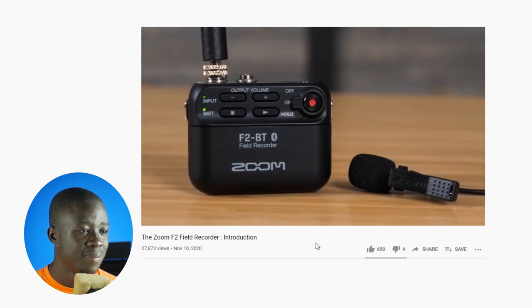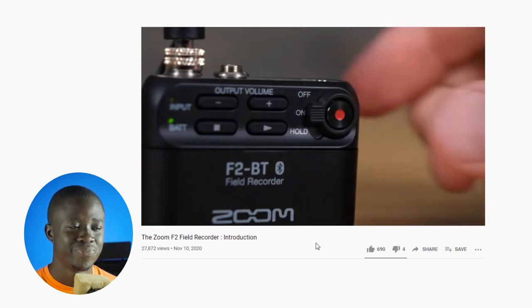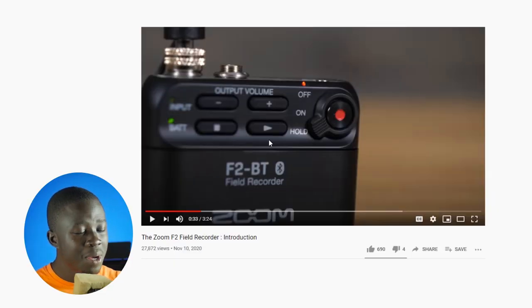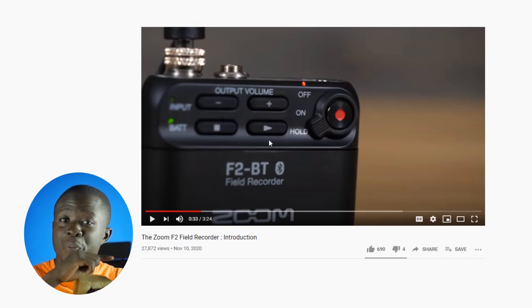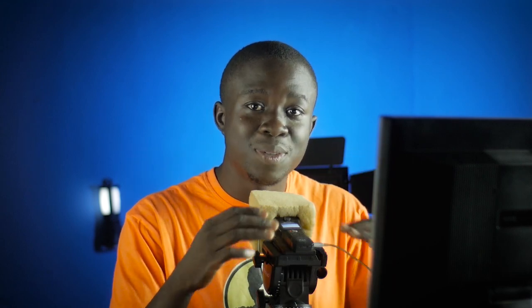There's a small package to keep in your gear bag. You run the included lavalier microphone, attach it to your talent, hit the record button, activate the lock, and put the recorder in a pocket. This is really huge because most recorders don't have this particular feature — the ability to lock all controls while recording. For example, if you're recording a wedding and someone accidentally presses the record button, they've stopped recording. It has happened to me before, so this lock feature is really significant. It means that even if you mistakenly touch any button, it doesn't respond while recording is going on.